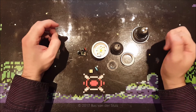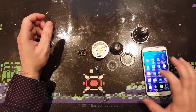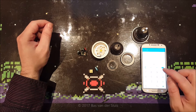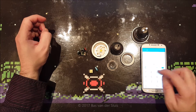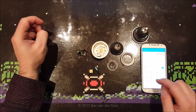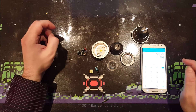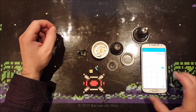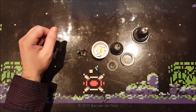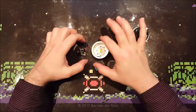Let's get the calculator out. Running for four years at nine hours a day — nine hours times the average working days in one year, which is probably 222 — so they're running about 2000 hours per year. Approximately four years old, so they've been running around 8000 hours. I think an LED can do better than that.